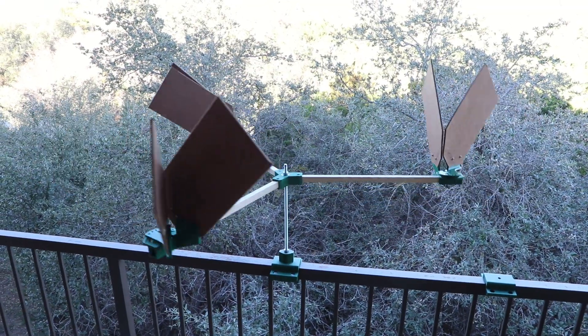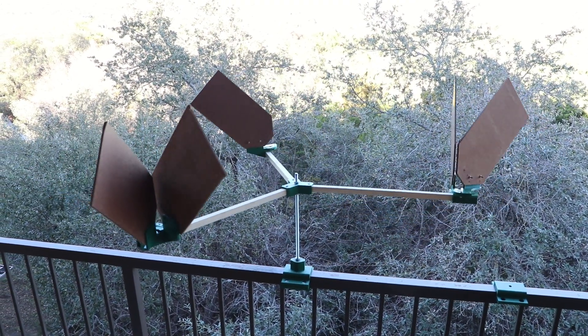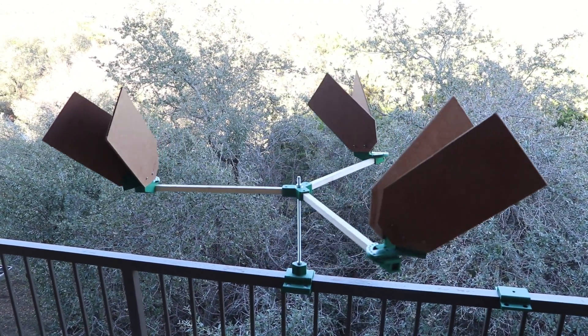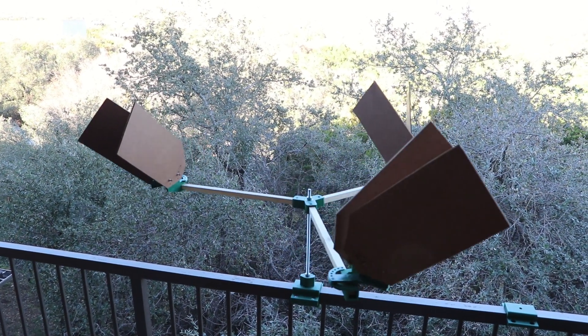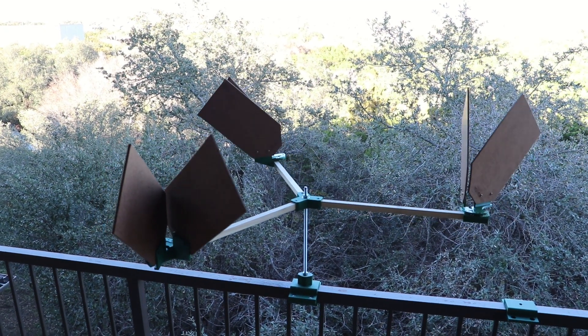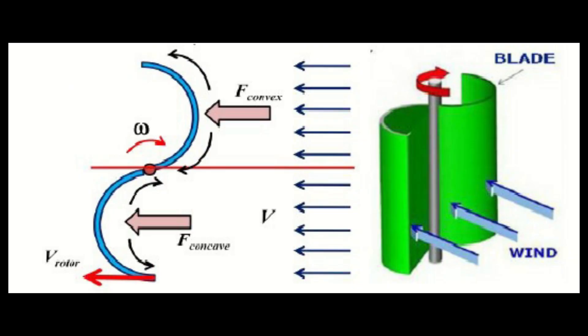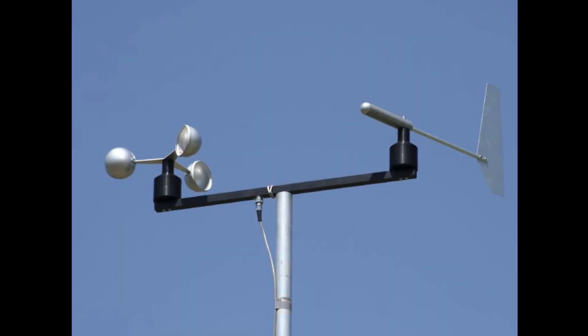For the next design, I wanted something that was infinitely variable. I figured you can shift the carriage along these square dowel rods and that sets your diameter. I added these little butterfly-looking wings with the thought that a wind turbine basically has a difference in coefficient of drag on the front of the blades versus the back — the fronts should be very sloped and curved and aerodynamic, versus the back which should be designed to collect as much drag as possible. That's basically how an anemometer works, those little cup-shaped things. That was my idea with this.